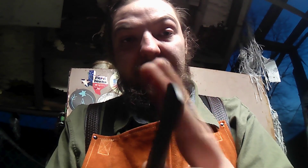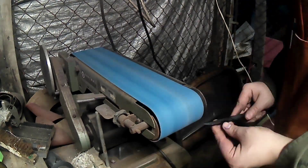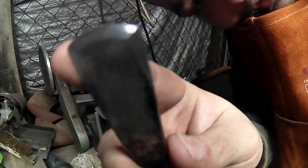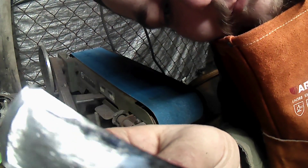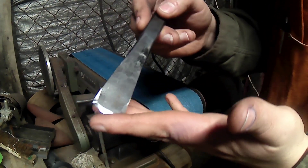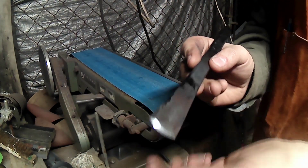We're going to put a bevel and sharpen this edge. We're going to do our little split edges on the sides here — just rough because it's thinner. The split edges on the very sides help widen out any cuts if we're going all the way through, and they help dig in whenever you start going deep. The corner is rounded so you can just walk it through a cut. Nothing too crazy sharp because it's all going into hot material.